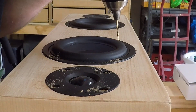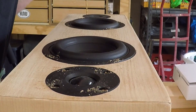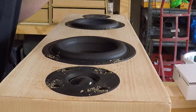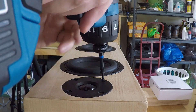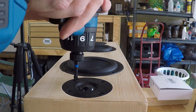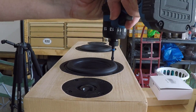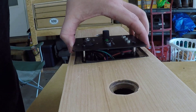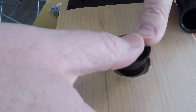You're going to want to pre-drill the holes. Whenever you're working with MDF you always pre-drill or you're going to split the MDF. You'll really need a power drill for this, but you can just screw the screws in with a regular screwdriver. These screws have a coarse thread and they're going to stick in the MDF much better than a sheet metal screw — and the screw itself is not fluted like a wood screw, so this kind of screw is what you want for speaker projects. Next, just take the amp assembly and squeeze it into the opening in the back and screw it down. The ports just press fit into the holes — plug it in and now we're ready to listen.